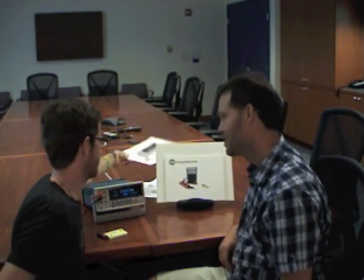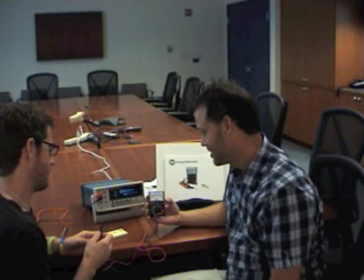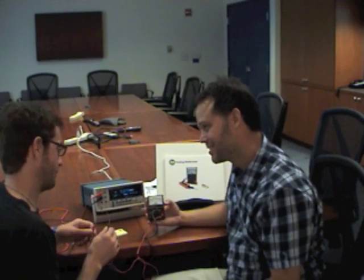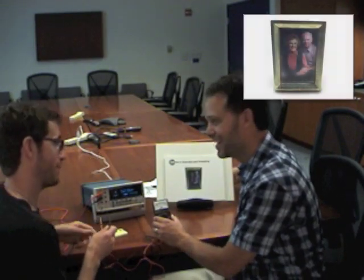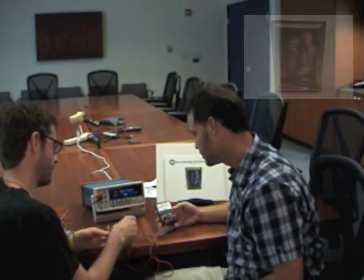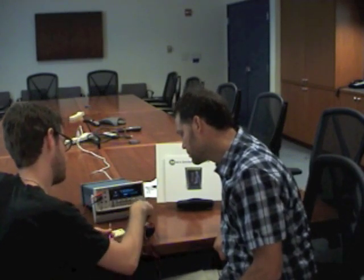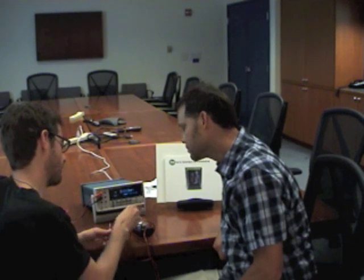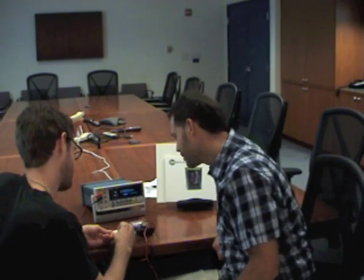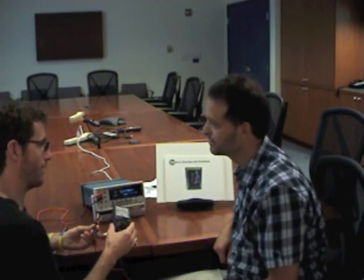Back in the old days, this is my first multimeter — an analog multimeter — my grandfather gave it to me about 25 years ago. You watch the needle while I attach the probes; this is 15 volts here. Each tiny tick is one volt, so we want it to move about three quarters of one of those small ticks. They look like they move the same, and they are pretty close, but I certainly couldn't tell the difference between 0.808 and 0.809 volts on this.